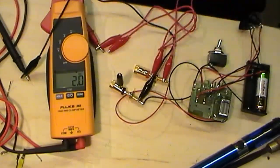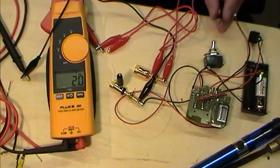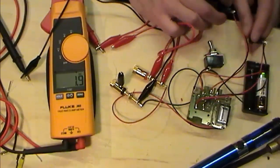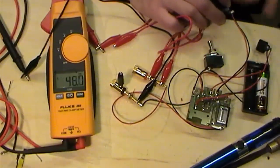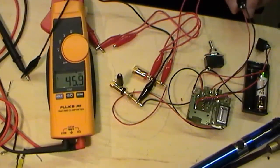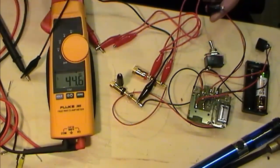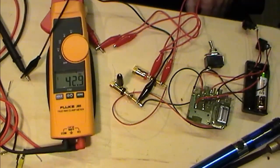The shock on there was incredible. Obviously, as I say, I had my test switch in, which does the same purpose. My test switch realistically in here was so I could test my circuit's working, to get me flash, just so I know everything. Now I can remove this one. It was a schoolboy error, because obviously I'm getting my short when I touch the two wires together. I didn't need that in at all.